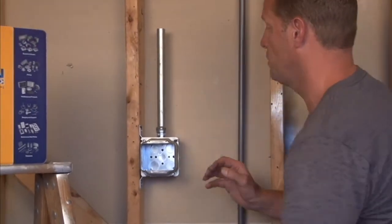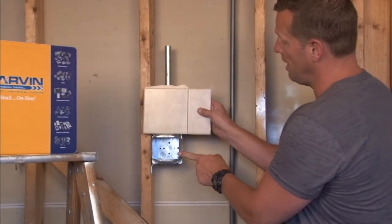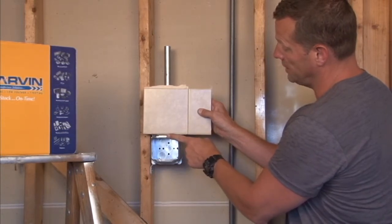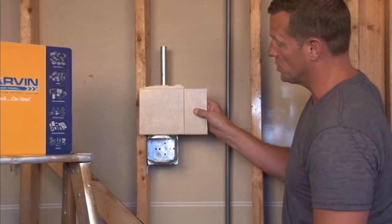It's very important to be sure that the finished wall depth is an inch and a half away from the stud wall, because you want your electrical devices to fit tightly against the ring and also against the finished wall surface.